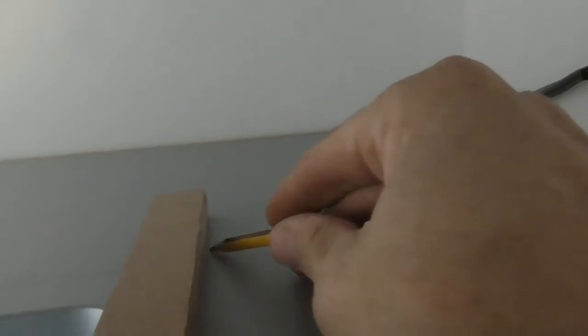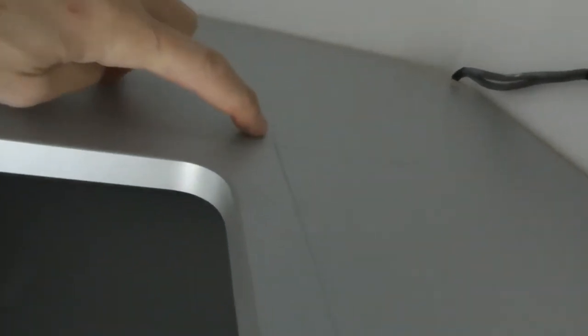That's the back line of where my cornice is going. And if I do the same on this side, it'd be nice if someone could hold the camera. I'm just trying to reach over there and put my pencil down the back there. Now when I come to measure how I'm going to cut this pelmet, I've got a measuring point, and that's the external point of the internal mitre, if that makes sense. It just makes it much easier because you've got an exact point to work to.